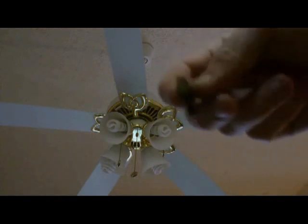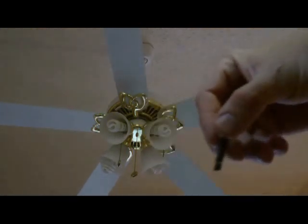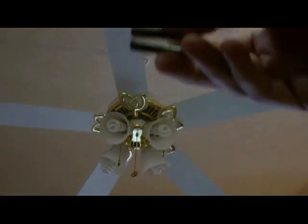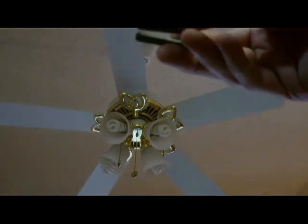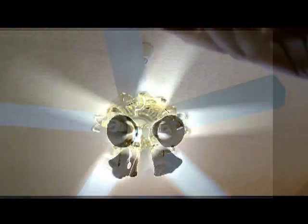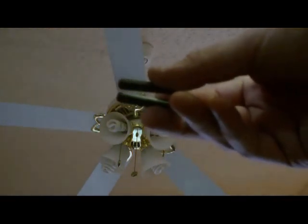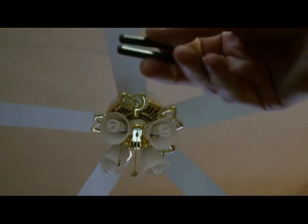and you're gonna slide it further up and down the blades of your fan there. And you're going to have it on the middle one, slide it out further, turn the fan on, and see if you get more or less wobble. Turn the fan off, then try sliding the weight towards the center of the fan and see if you get more or less wobble. Adjust it accordingly.